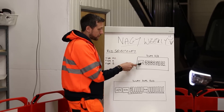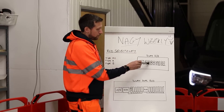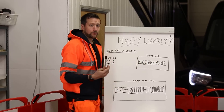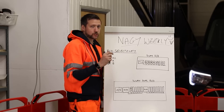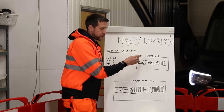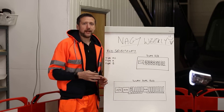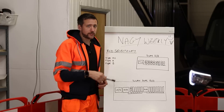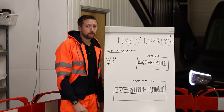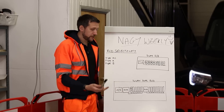This is where my argument started. If Betty Crocker is coming down the stairs with her tea tray and that RCD trips in a big townhouse, she could fall to the bottom of those stairs. That's my first problem — no discrimination. The second problem: when you add multiple MCBs onto one RCD, the more circuits you add, the more leakage you're going to start getting, especially on socket circuits.